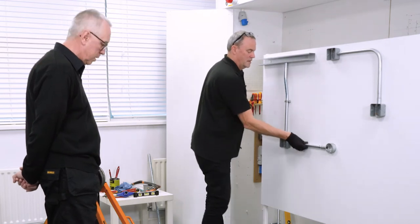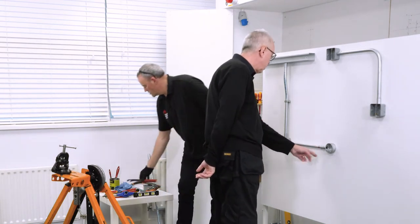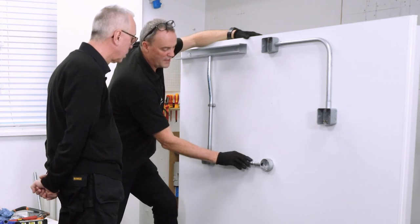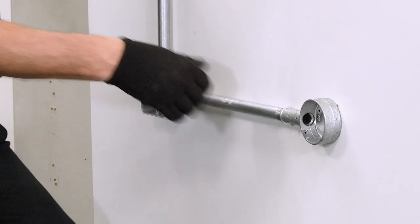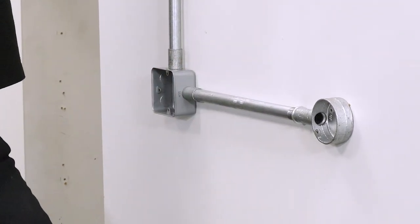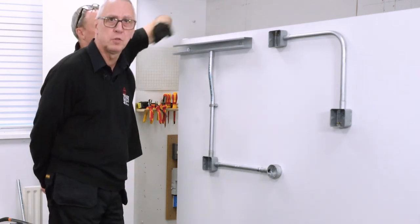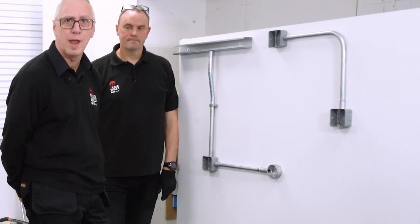As you can see, it's very firm. Previously you didn't have any threads showing — is there no way around that? There is, and that is one of the things that is accepted. However, what you should do is — because you've cut through the galvanized surface protection — you need to use some form of galvanized spray, just to spray over that to stop it rusting, particularly if it's in that kind of atmosphere. That is fantastic — it's solid, not going anywhere. So there we go: how to connect between two fixed points using a running coupling. Thanks to Steve. If you liked this video, please like and subscribe, and we'll see you next time.